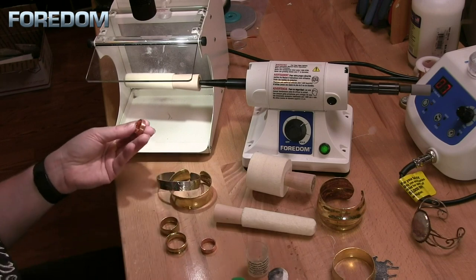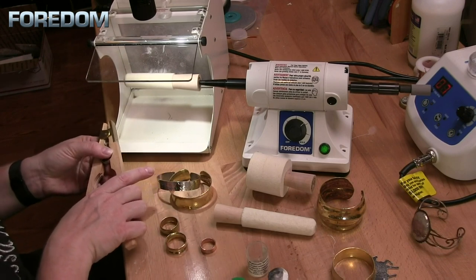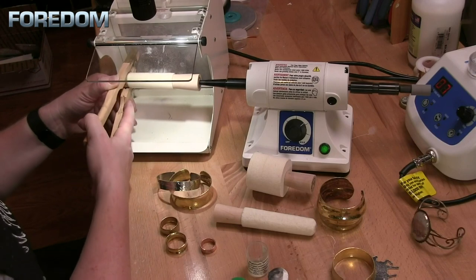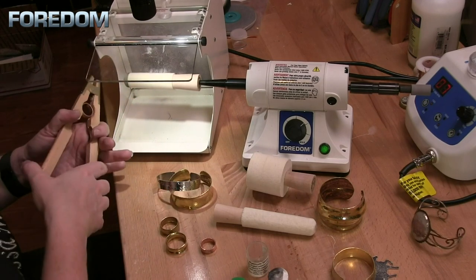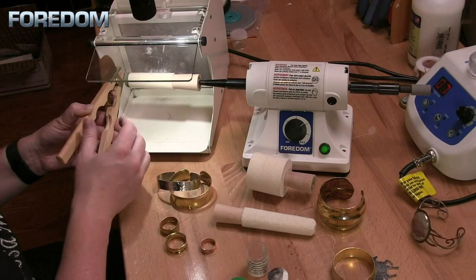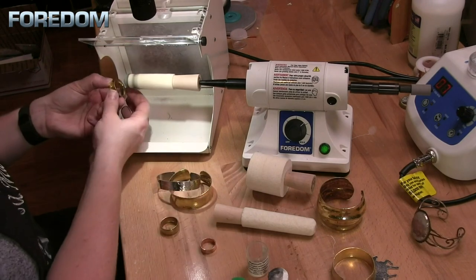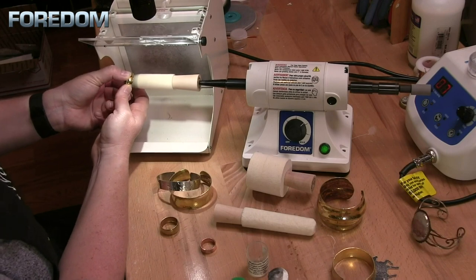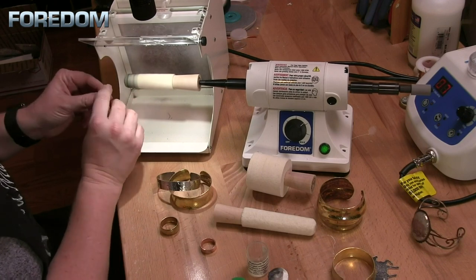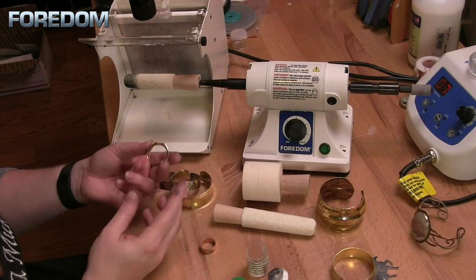One of the things I like to do when doing an inside ring — I can come in and hold the ring myself, or I can use a ring holder that will allow me to bring it in a little bit more safely. In this case my ring is just a little bit too small for that, so I'll do one side and then the other. As this buff gets used it will compress a little bit, but now I have a beautiful inside polish on my ring. I can also select to do this by hand — the key is that you've got a good secure hold on your piece.